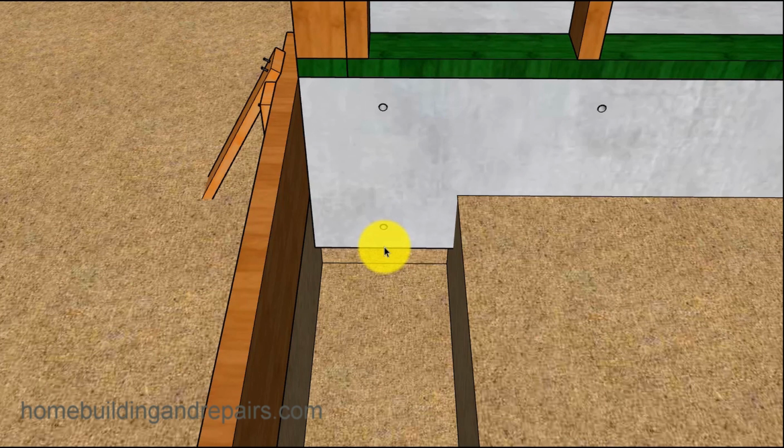I am going to position them in the center here, and it needs to be, I believe, no more than 3 inches from the exposed concrete, top of the concrete. You can even go 4 inches if you have the room, and then maybe 3 inches down at the top. Now these here, and I have them lined up here, I'm going to have a 5-inch wide concrete slab, and it wouldn't be a bad idea.